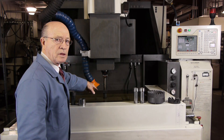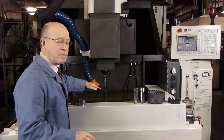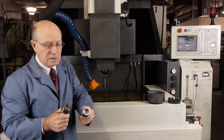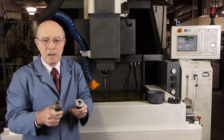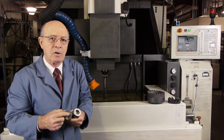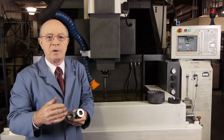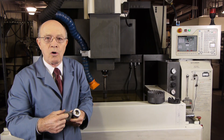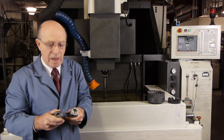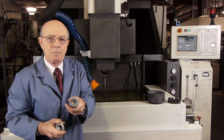There's a filtration system that removes the eroded particles from the oil. This hex electrode in the machine does not have a hole in it, so this will give us a flat bottom. Generally when we make a hex — as you can see, these are two large bolts — you drill a hole inside because you don't have to EDM that part. We charge RAM EDM according to the cubic inches of material removed, so drilling a hole reduces the cost. Then this hex was plunged into the hex bolt.